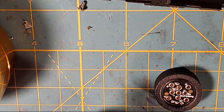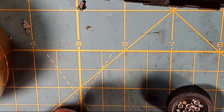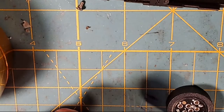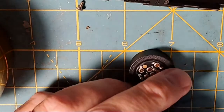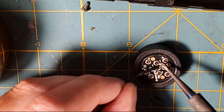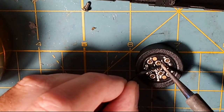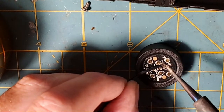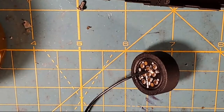Okay, so I think I'm going to come up with my negative first, and my negative line, I pinned a negative pad there. And so I'm going to come in here, put a little bit of solder on my tip. Hopefully, I need to be where you guys can see it. I'm going to come in here, and I'm going to bloop it on there. And I don't think I have touched the data there, so we're solid there.